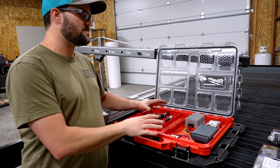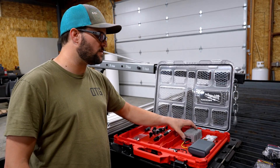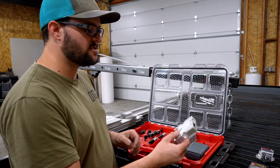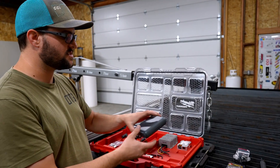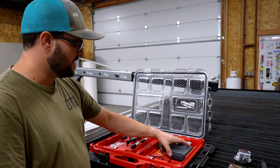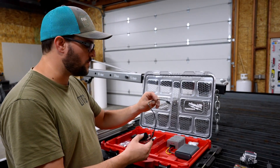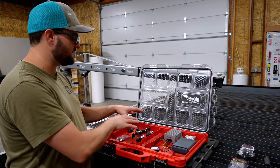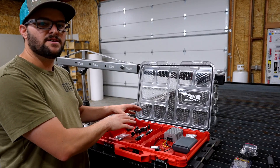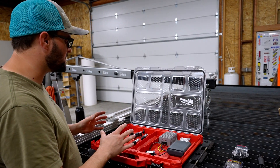This control box is going to house all the rest of the stuff. We will have our step-up converter from 12 to 48 volts, the injector that will power the Starlink and connect to the router, the router itself, and also a power module that will power the Wi-Fi router. All of those things will be hard mounted on one side, and in the other section is where we're going to have the spare cable — 50 feet or 75 feet, whatever we go with.